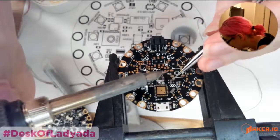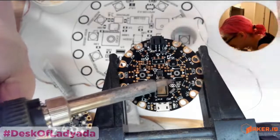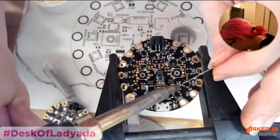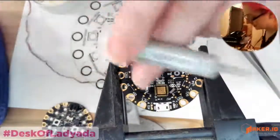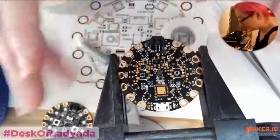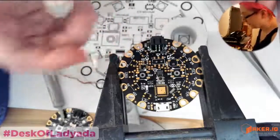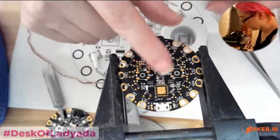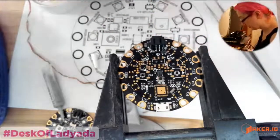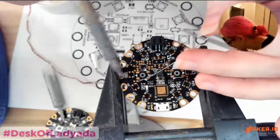Do you usually bring up boards at the Adafruit factory or at home at night? I usually do it at Adafruit because we have a pneumatic paste dispenser, which is kind of like this, but connected to a foot pedal. What you're doing right now is more accurate of what maker to market is. Yes. I bring up tons of prototypes every week, like 10 boards a week sometimes. So you want to have a pneumatic paste gun that puts dots down, and you use a foot pedal and it'll eject a little dot of paste, and then we place the parts and it goes through the oven. It's very fast. You can do a whole bunch of prototypes at once, but it's not realistic for home. It doesn't really make much sense.